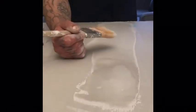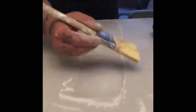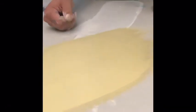The paint I'm going to use already has primer in it, but this is brand new drywall so you do need primer. But for teaching purposes of the compound and the five-minute bag spackle, I'm doing it anyway. I spackle it right now and I'm painting it right now. It ain't going to give you a different finish than if I would have let it dry exactly. But like I said, I try to get things done quick — when you're working in people's houses and you only have a few hours, this is what you do. That's how you fix the hole real fast — spackle it, compound, and paint it like that.